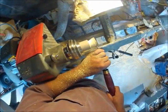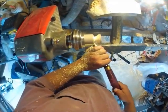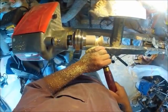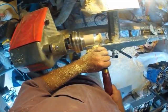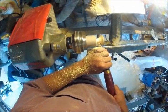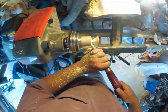Kind of try to swallow that inside one a little bit. The last few cuts we want to make really consistent, and we want to take as little as we can, so we can remove any tear out that's there and not add any more. When I waste away a lot of stuff, I end up leaving a lot of marks and tear out.